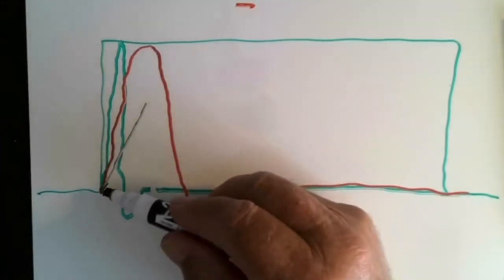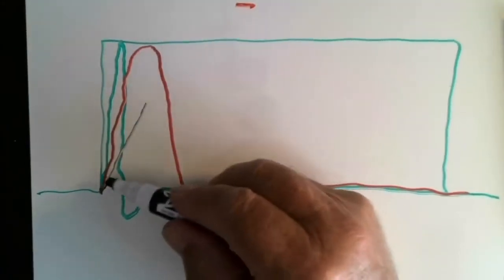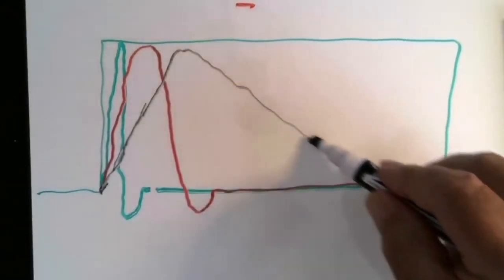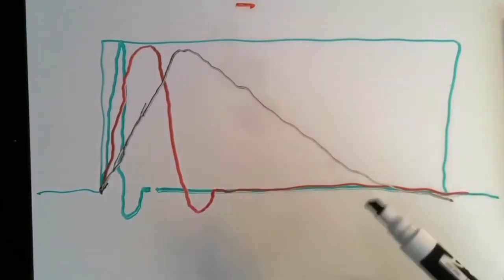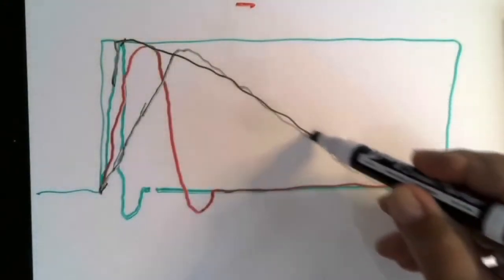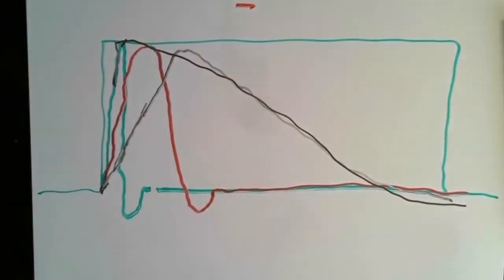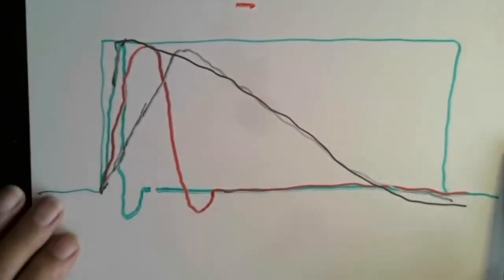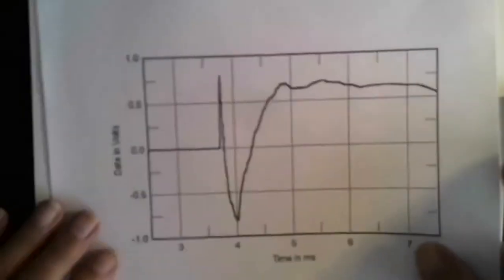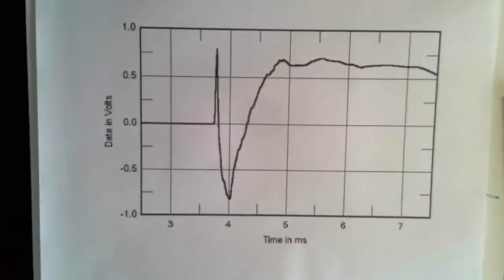And you notice all the high frequencies have been rolled off. So it has a big slope to it. Goes to the top, goes down here to the end. When you sum all these together, you get that waveform that you saw. A speaker that is not time and phase correct will look like this. We don't talk about who this is or what it is, but there is one.